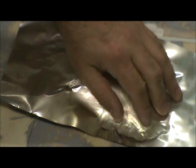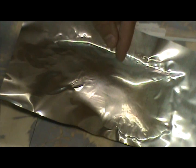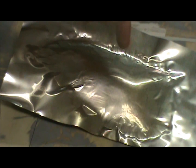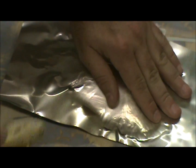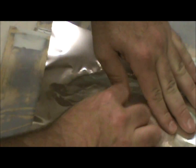And then when you have a section like that where it's curved in every direction, and then you have to stamp it for your rivets, because you can't stamp it beforehand because you don't know how you're going to trim it for your rivet. So then you have to make the panel and then figure out a way of holding the panel while you rivet it. It becomes very difficult, but it's kind of fun at the same time.